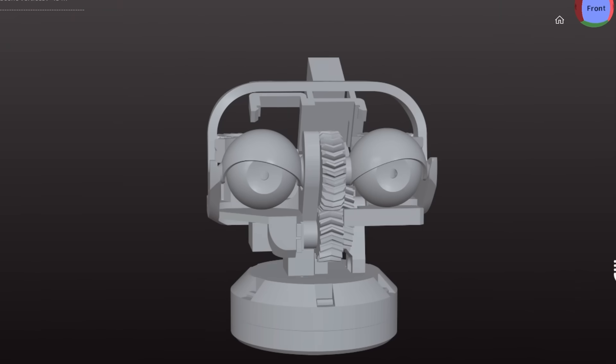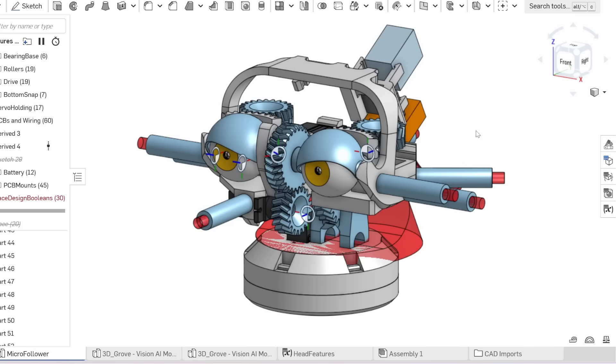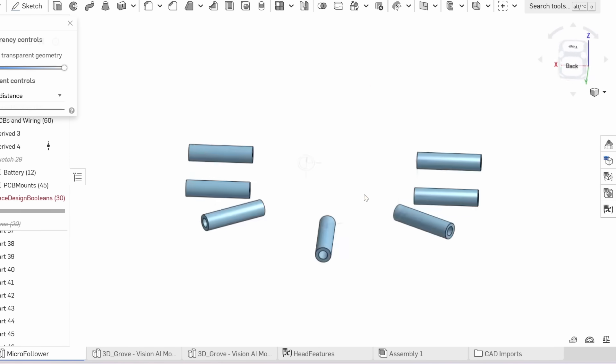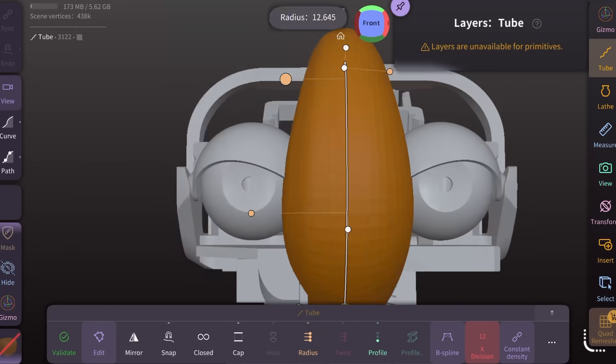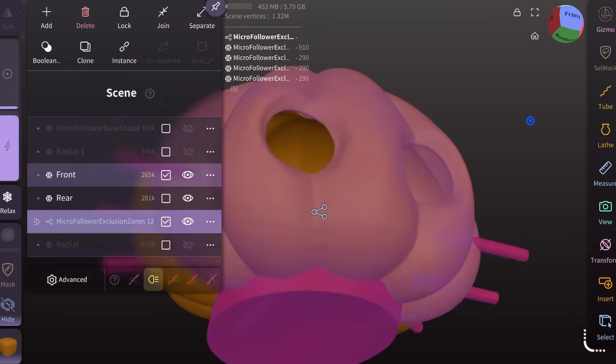Now this is all working and it looks pretty cute, but the final piece of the puzzle was to give it some kind of skin. This was definitely not a job for CAD, so I decided to take the design into a 3D sculpting program. I've faffed around a lot with the workflow between CAD and 3D sculpting and at times it's been a nightmare, but now I've figured out a process to make it as painless as possible. Step one is to figure out how it's going to attach in CAD — I extruded screw bosses which will eventually be merged into the shell design. I also made all of the exclusion zones for areas the shell can't touch, either because a screw goes through there or the mechanism moves and needs that space. In total I export three models from CAD: one is the base model, two is the exclusion zones, and three is the screw bosses I want to include in the shell design. Then once in my sculpting software — this time I used Nomad Sculpt — I can make my design, trim the bosses to fit the outside shape of the shell, and subtract all of the exclusion zones.